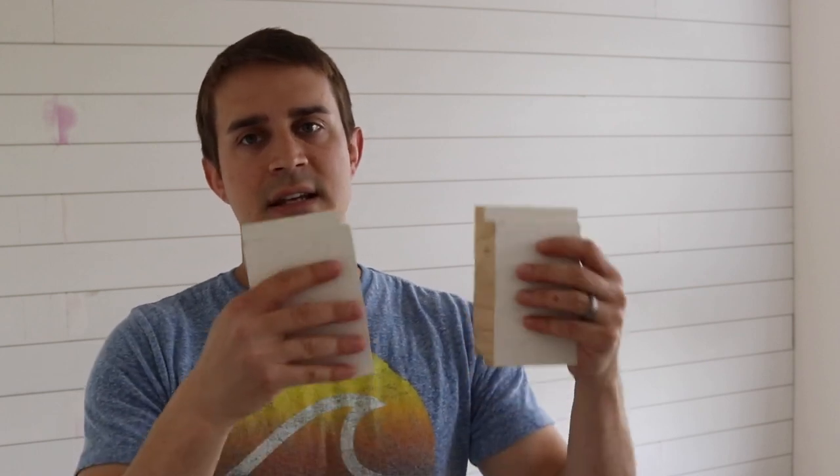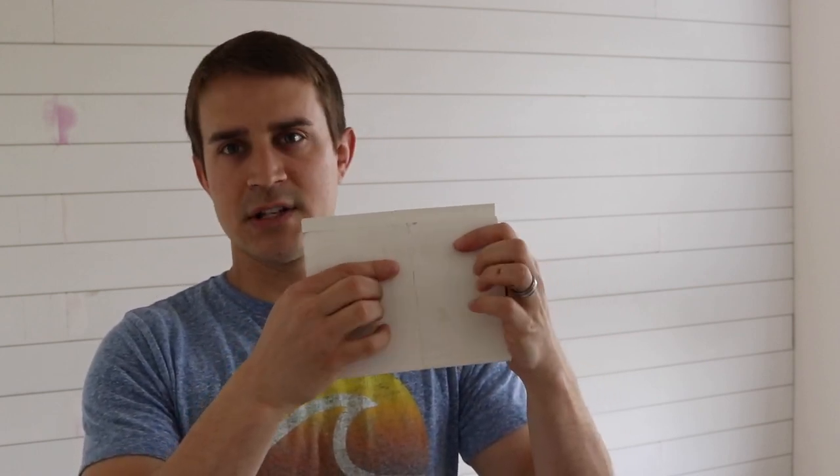Another way is to cut a 45-degree miter cut — when you join those two together it tends to hide the joint a little better, similar to what you'd do with chair rail molding. With some of my measurements I decided to just do the butt joint, keep it simple, and spackle over the seams. You can't really see them and the shiplap is supposed to be a little rustic, so we're happy with that. A miter saw does give a slightly cleaner seam between the two.